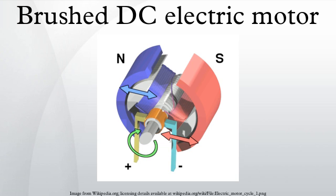A clear downside of this simple solution is that the motor now coasts through a substantial arc of rotation twice per revolution and the torque is pulsed. This may work for electric fans or to keep a flywheel spinning, but there are many applications, even where starting and stopping are not necessary, for which it is completely inadequate, such as driving the capstan of a tape transport, or any instance where speeding up and slowing down often and quickly is a requirement.